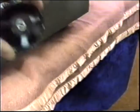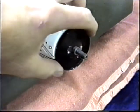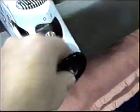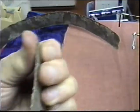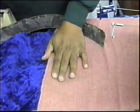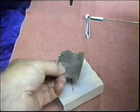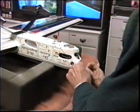This is one of the problems everybody always has. You go to tighten up the prop, and now the plane's been sitting, and it rubs on the back plate. The motor is in just a little bit different position. So we're going to make some sandpaper washers. This is an old 80 grit sanding belt from the shop, and this makes the best. Just drill a hole first. If you want, even drill it on a drill press. You need to gain a little prop space. Boy, that's worth its weight in gold. Put that on and you'll be in Fat City there, my boy.